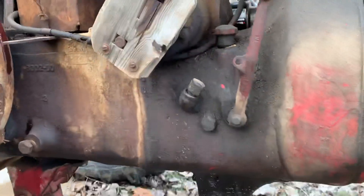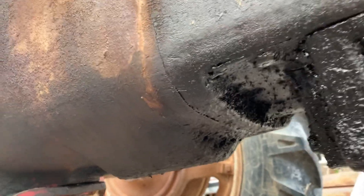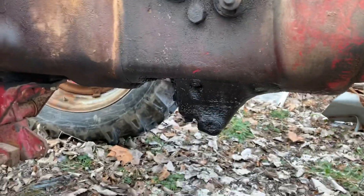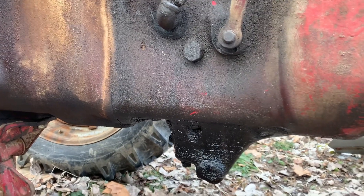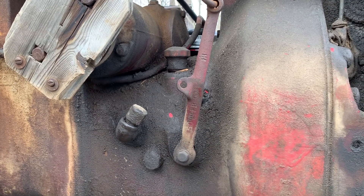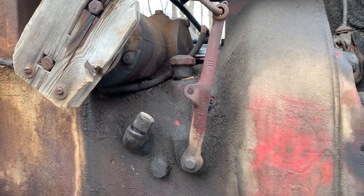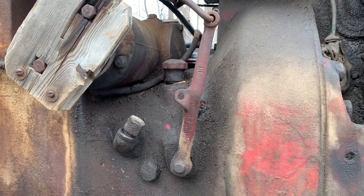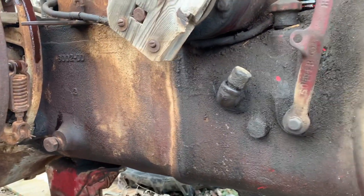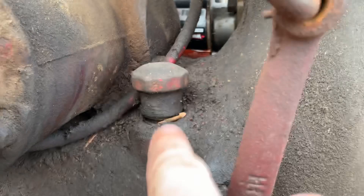This is the standard issue International belly pump. It drives off the front of the rear end — there's an output up there with a shaft that runs along to the belly pump, so the belly pump actually runs all the time. It drives off the countershaft of the transmission, so it's always spinning. When you pull this lever back is when it actually makes pressure. There's a little flapper in there that basically covers a port — it's constantly bypassing, and when you pull the lever back it stops the bypass and builds pressure. That makes the hydraulic system make things go up or down, however you've got it plumbed. This is one outlet here, and there's your fill port — there's usually a dipstick in there.